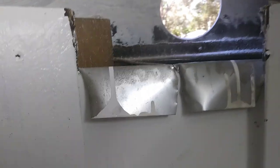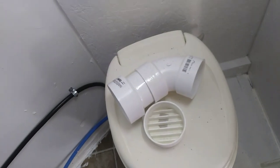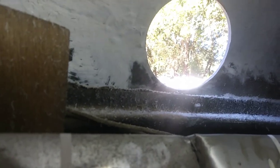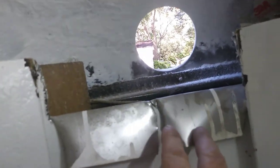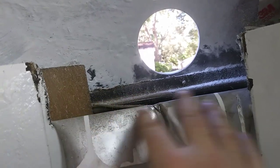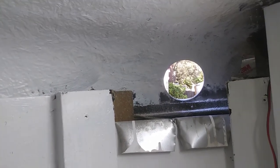All right, so we decided to go above the rib. I was going to have to cut so much down that our ventilation would have been so low — I didn't want it that low, I wanted it up higher. We'll fit everything together. I had to cut my three-inch pipe to come through, and it actually works out pretty good because now I can anchor into this rib instead of just the fiberglass to hold the pipe assembly. It wasn't originally planned but it'll be all right. I'm going to cut this stuff back, finish cutting that off. I've got a flapper wheel — clean it up nice, get it mounted, and we've got that foam sprayed to seal this sucker up. It wants silicone in the pipe and everything to make sure it doesn't leak — silicone on the inside and outside.